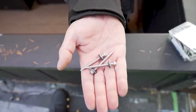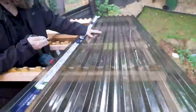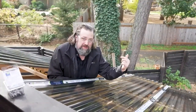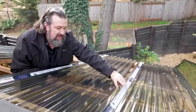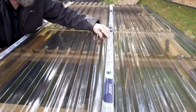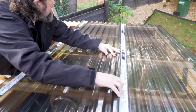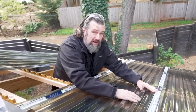The secret of the fasteners on these is the little rubber washer on the bottom — that way the rain doesn't leak through. Now let's get this overlap right. Because the winds come from this direction, that's the prevailing wind, so I want everything lapped the right way. I'm going to slide this panel underneath so we have this cool little lip over the top. Once that snaps in like that, we can fasten through the top, and it's locked in so the wind doesn't drive any rain underneath.